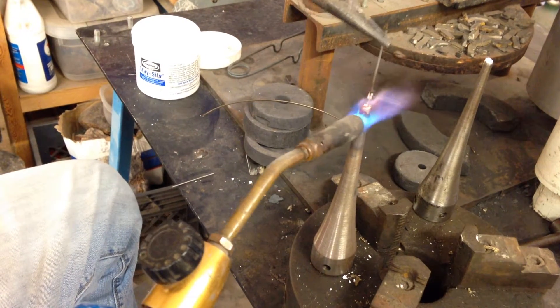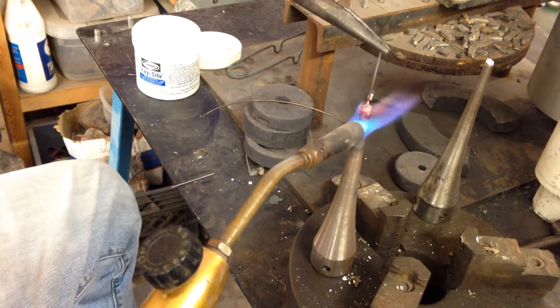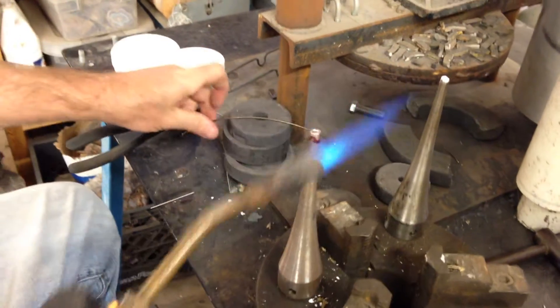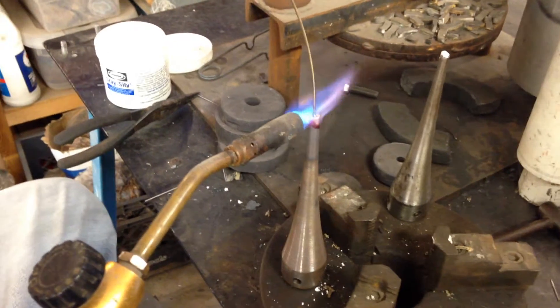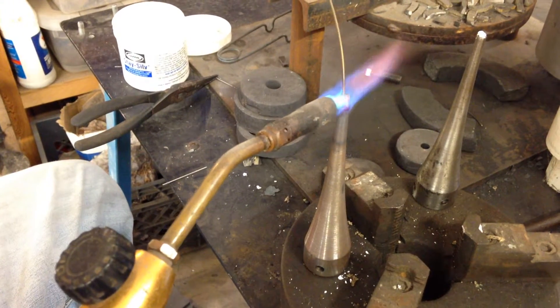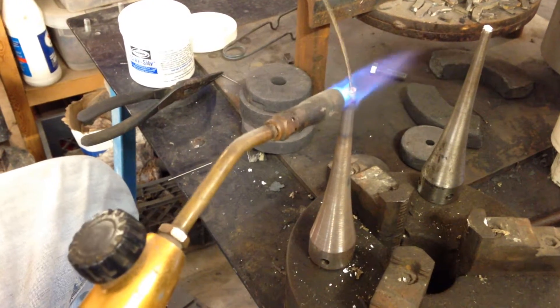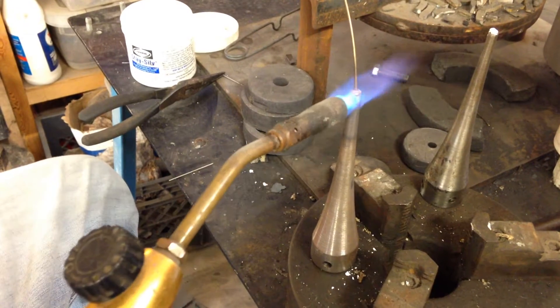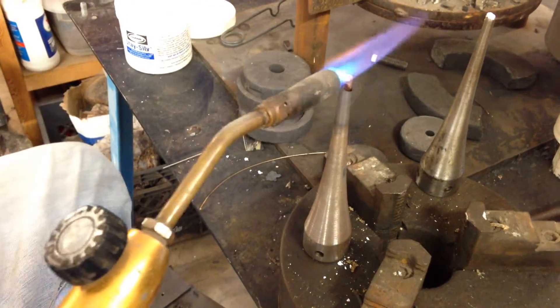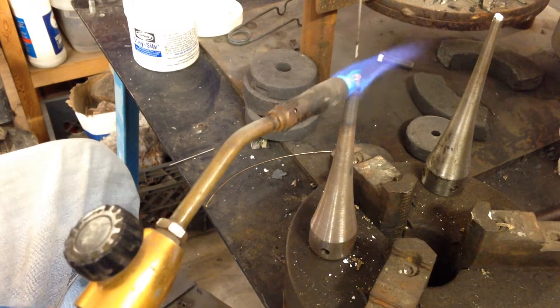You can see I've got that air pocket in there. This one's drilled a little deeper — I think I need some more silver solder. Once you fill it the first time with silver solder, that silver solder just stays in there, and when you change out pins, you don't have to use very much silver solder at all.